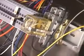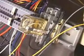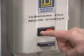The electrician should connect the coil of the fan interlock relay to the motor control circuit for the moist air fan so that the relay is energized when the fan is turned on and de-energizes immediately when the fan is turned off. In summary, paying attention to details in the installation process will provide a unit that is easy to care for, safe for gin personnel, and will provide the gin with many years of profitable performance.